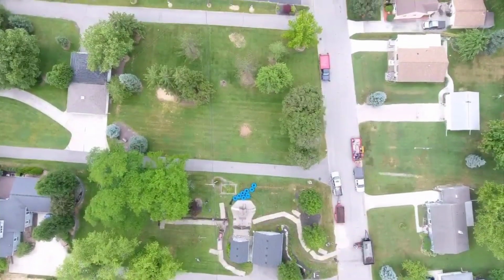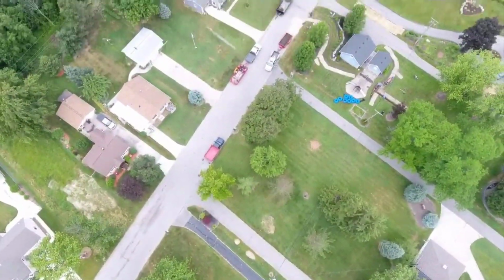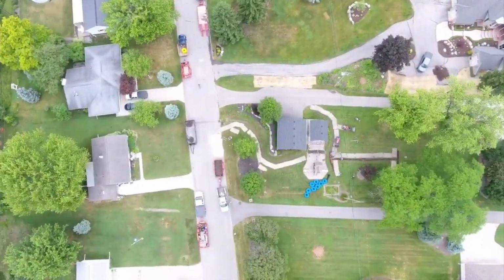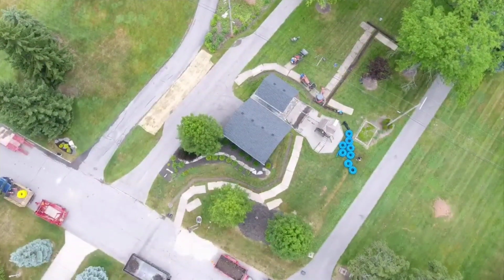I like the trench to be 16 inches deep and at least 18 inches wide for a quad. Now you're really moving some water. You're really drying out the yard, because think about this. Look at all those obstructions. Look at our plywood road. Wind through all the landscape beds and outbuildings and play areas.